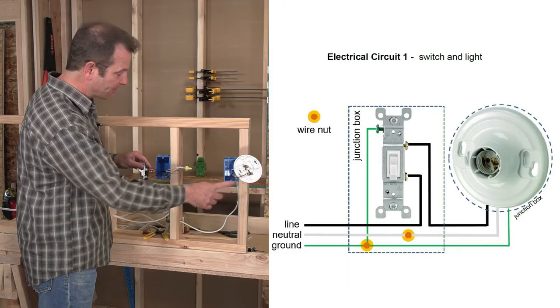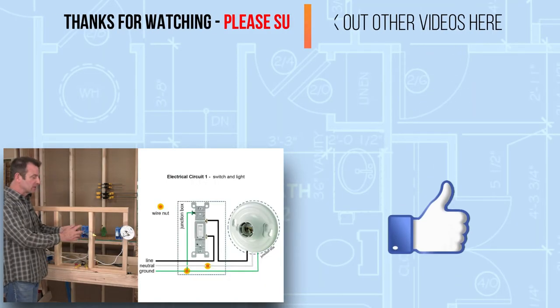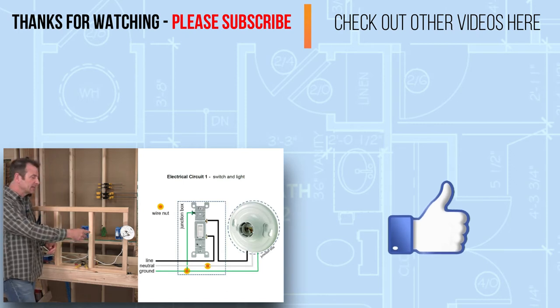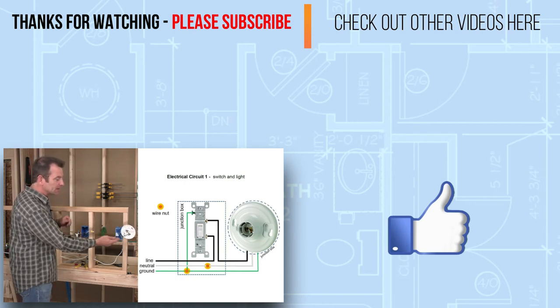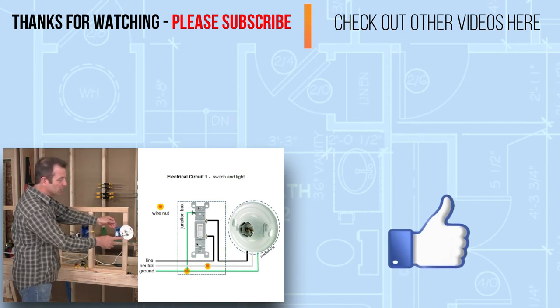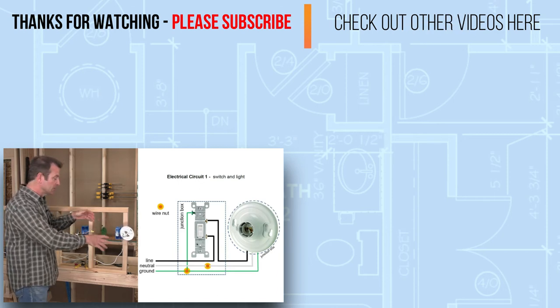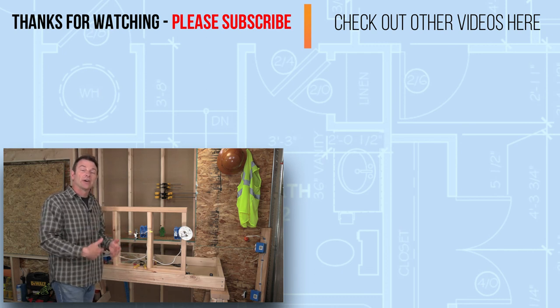Here's my neutral. That's my white wire. Keep in mind that our neutral wires don't have anything to do with our switch, so they carry through this box with a two-wire spliced connection, and they carry to our light socket, and they terminate there. There is no ground lug or terminal on this light socket, so my ground wire is not used. So in a nutshell, that is our working circuit. You're now ready to evaluate and test this circuit to see how well you did.